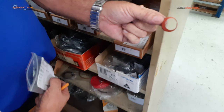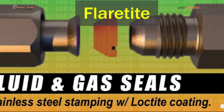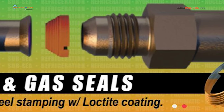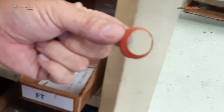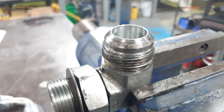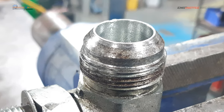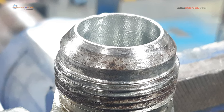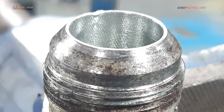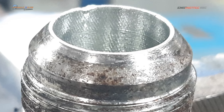These are a special little seat — there's a special name for them I can't remember right now — designed to assist in sealing male-to-female JIC hose fittings. They're actually a stainless steel tapered cone coated with a solid Loctite product. If you don't have quite the right sealing surfaces, these will take up any inconsistencies — whether there's a little corrosion, machine marks, or indentations caused by foreign matter. Used a lot in marine applications; very expensive for what they are, but better than changing out adapters and hose ends.